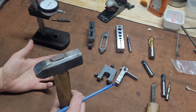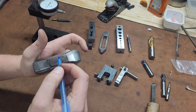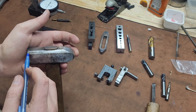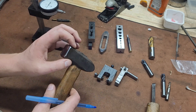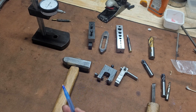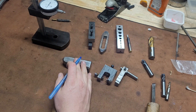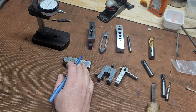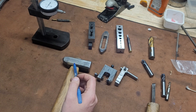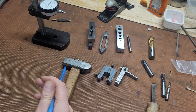Another really fun get-started hobby project is this machined hammer out of a block of 4140. I machined the eye, machined the head, and ground it. It's a really good project to teach you how to make chamfers — you have to chamfer the face. That's a good realistic project: you're going to make mistakes, you'll have to embrace that part of the process, and you're going out and making something. I think this is realistic for a first project on a milling machine if you take your time. I think this was one of my second machine projects — I broke three tools on this — and obviously you run what you brung, using whatever machine you own.